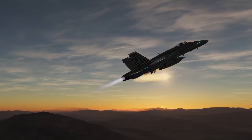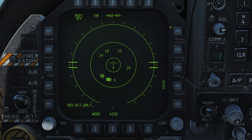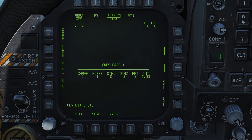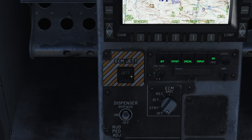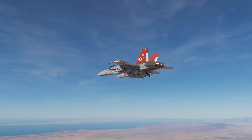The system is essentially in a backup mode of operation at this point. It bypasses all the countermeasure controls and has a few limitations. First, it's all manual. Second, you cannot get information such as the remaining chaff and flares on your EW page, owing to the system being turned off. We also have the ECM Jettison button.